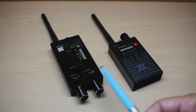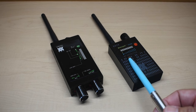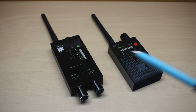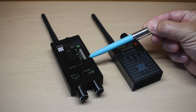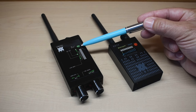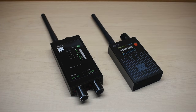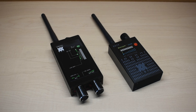The big difference between the two units is that the M8000 can detect up to 12 gigahertz, while the G318 can only do 8 gigahertz. The M8000 also has an auto and RF setting. When searching for a hidden transmitter manually, the signal bar will rise higher into the red zone as you get closer. But if you push the run button, it switches to auto mode — it scans the area for the strongest signal and sounds an alarm when you're very close to the target.